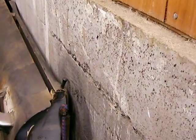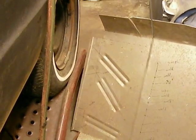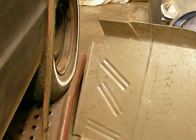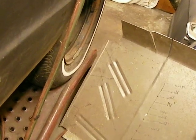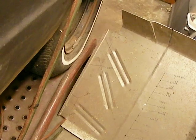By the way, I have this thing that I fabbed up a while ago, and I'm going to use it. It's pretty thick gauge. You know, stamp those furrows in there using a hammer, and I rounded the ends on, I think it was about a 3/8 nail, huge nail shaft, and I made kind of a jig for it with two 3/4 by 3/4 bits of angle iron mounted in wood next to each other, just kind of a jig to hammer those furrows down into.